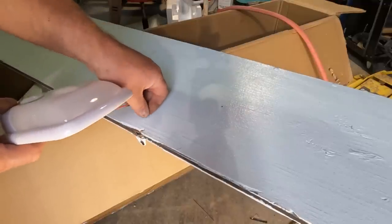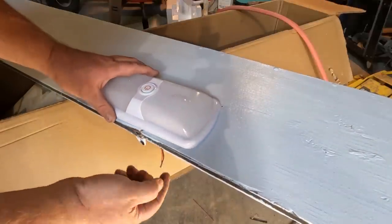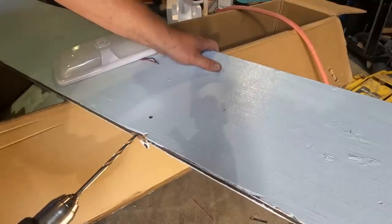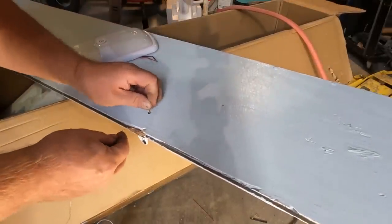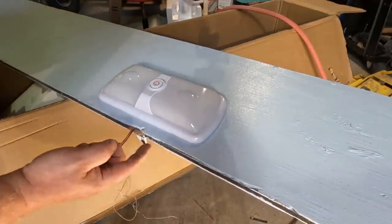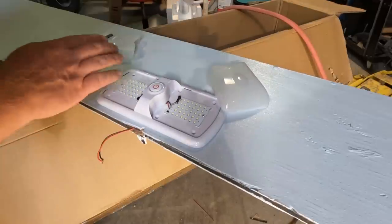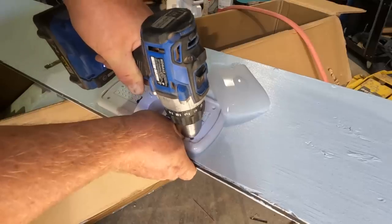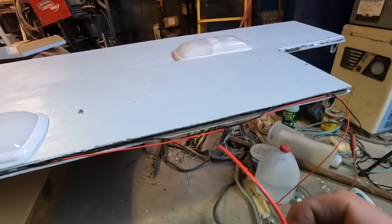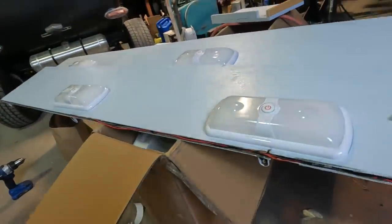Previously the lights were run on the bottom of these shelves with wires running all the way through to the other side, then another wire run along the top of the shelf. But I'm noticing this is made out of tongue and groove material. I'm going to fish a wire through the groove. So what I'll do is connect all these wires while the shelf is out, run them in this groove, then bolt the shelf on with one wire coming out the end — like an electric shelf. I've got one of the shelves put together, wires in the groove, and I'll be able to connect it off the end. Switch is turned on — yep, that one's ready to go.